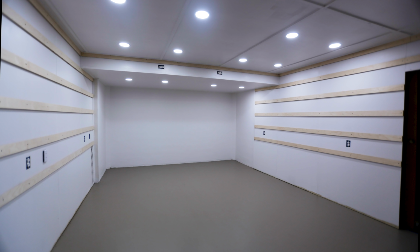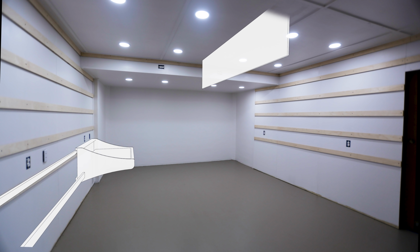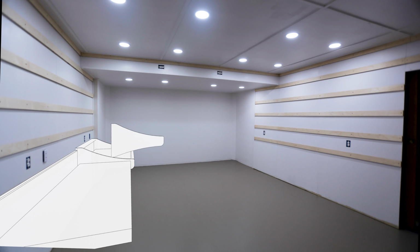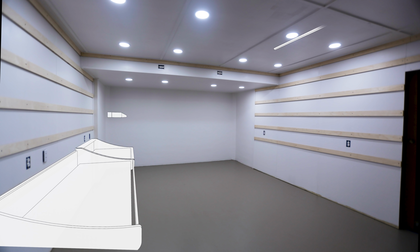This is part 2 of the craft room series, and in this video I'm going to build the new desks for the room. In thinking about the desks that we wanted to make, I wanted to make something that would hang off the cleat system on the walls, and where the lowest cleat was too high for the height of the desk that we wanted. So I came up with an idea where the desk would be both hung from above a little bit and supported from below and cantilever off of the wall.